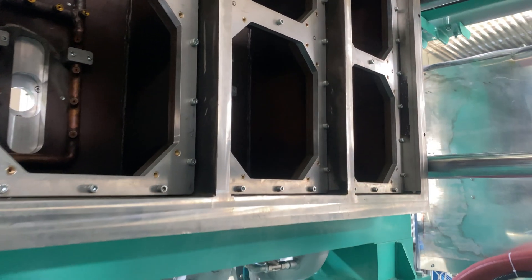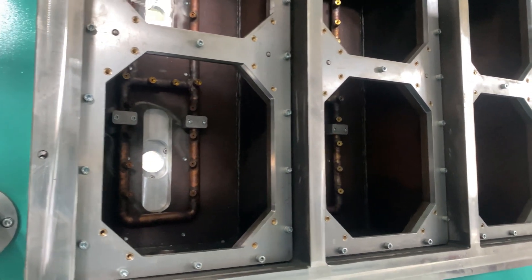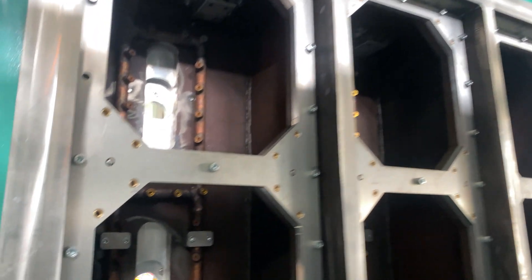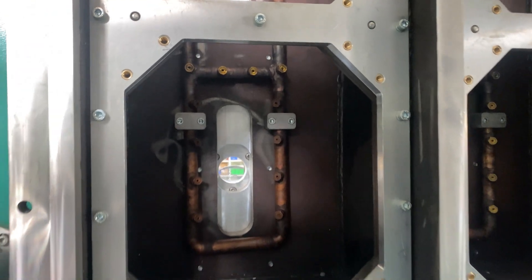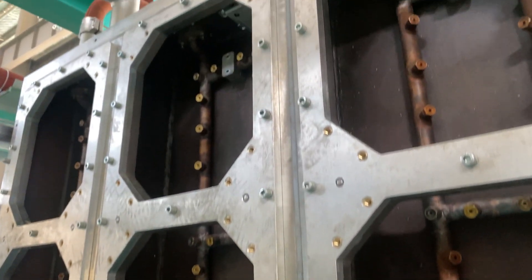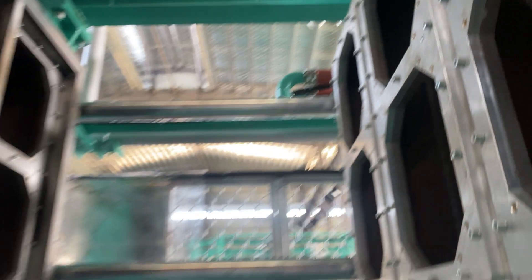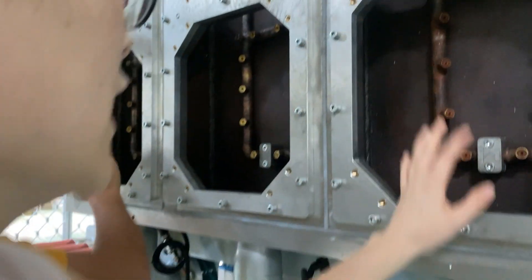As you can see from the video, three groups of steam chambers are controlled separately. The upper and lower two helmets are in one group, so in total they have three groups with six cavities. Each group is installed with a pressure sensor, so the heating time, heating pressure, and cooling time of each group can be controlled individually.